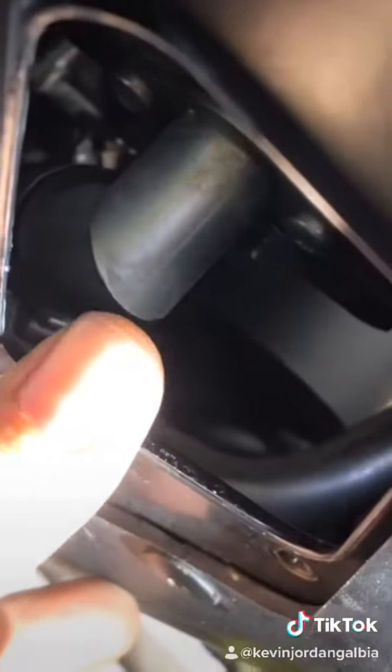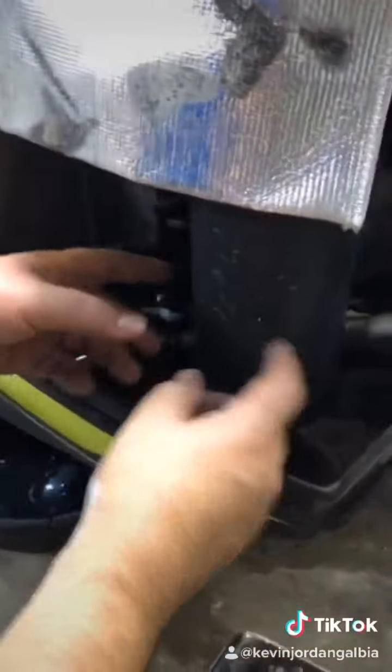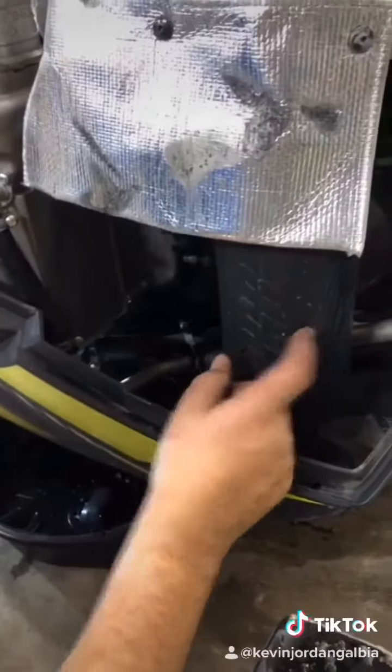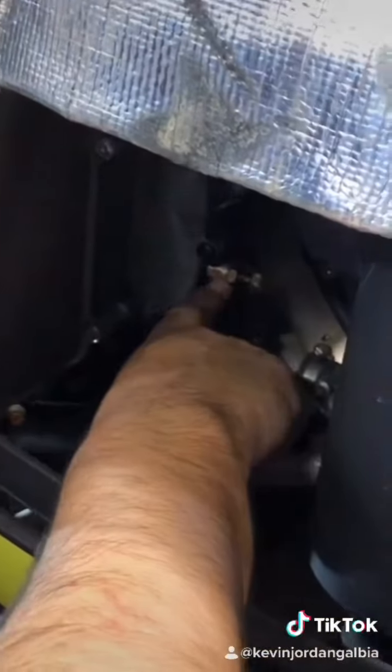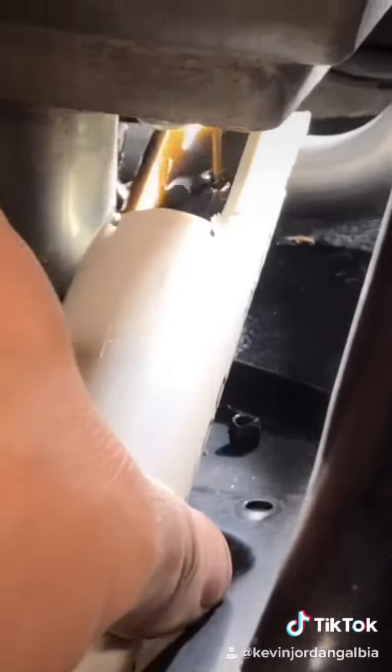We're gonna make ourselves a special funnel to get the oil to come out of the engine compartment at the bottom of the skid, and we'll be right back. Okay, so I'm very fortunate. I got this GGB mountain can. The factory can is this big. With this GGB can, I can get to my chain case chain adjuster screw, and I can also get to my oil drain screw just right here, nice and handy, right with my hand. Okay, so we're draining our oil with our special little pipe we made that we cut a few directions, and it seems to be working pretty good. We're not draining very much oil in the bottom.